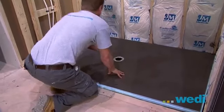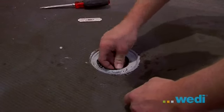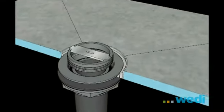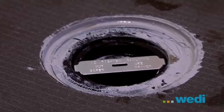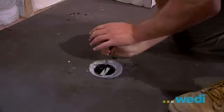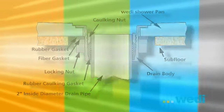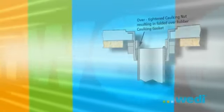Compress the base into place by stomping on it. You should now be ready to insert the rubber drain gasket. The double bevel edge should be facing up. The gasket is going to be inserted between the 2 inch drain pipe and the inner drain assembly. This is a snug fit and you need to fully press the gasket into place so the top side of the rubber gasket is below or flush to the top of the drain pipe. It's imperative that the gasket is not sitting above the 2 inch drain pipe. To set the gasket, twist the threaded nut into place and use the tightening tool provided with a screwdriver to firmly tighten and compress the gasket into place, creating the proper seal. The following diagram shows how to install the drain and gasket correctly. You'll notice in the second diagram that if the drain pipe is too low you cannot correctly compress and seal the gasket. Take your time to ensure doing this right.